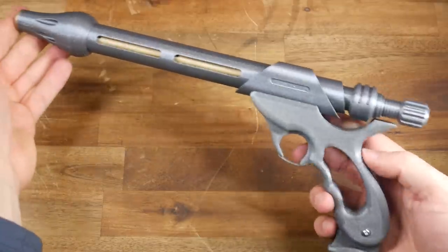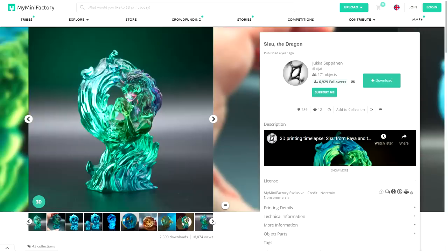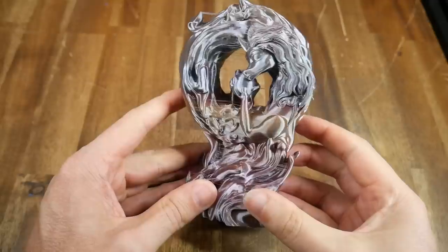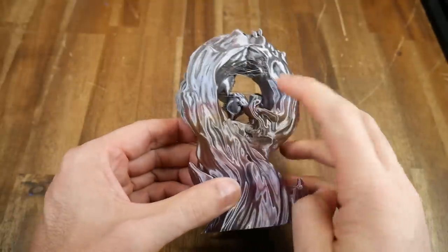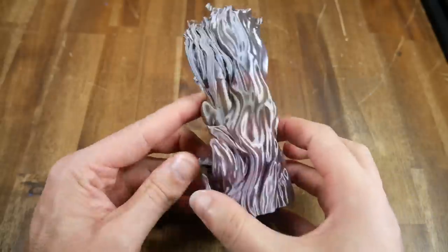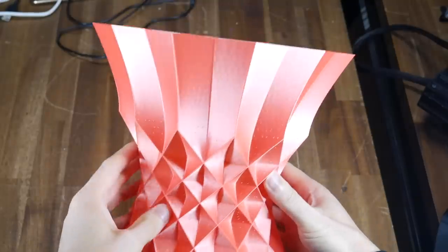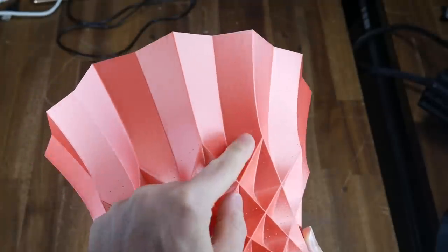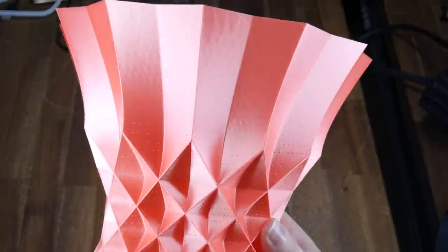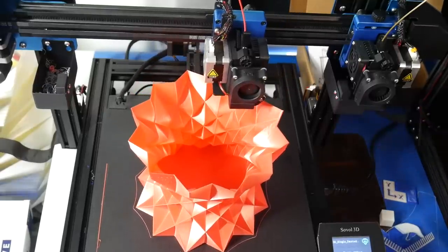Little Boba was certainly happy to have his dad's blaster. How about something really decorative — this Sisu the Dragon model by Yuka Sepinen. I picked some highly glossy colour changing filament, and we have the same trend as the other prints. You would describe almost everything about this print as high quality, apart from the fine stringing. Next up, a faceted vase. Overall this one looks good, particularly the way the light captures the different facets, but there must have been some type of micro stuttering, as there are artefacts here that weren't present in any of the other prints. I couldn't perceive anything at the time, so this one's a bit of a mystery.